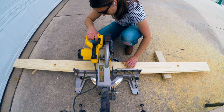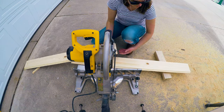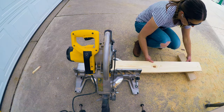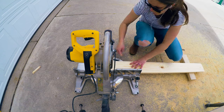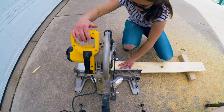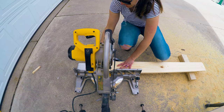The next step is cutting the shiplap to size. This will be the section that fits inside the dados that were 3 1/4 inch. The doors I'm creating are for a 4-foot opening. So for 2 doors, you'll need 6 of these pieces.